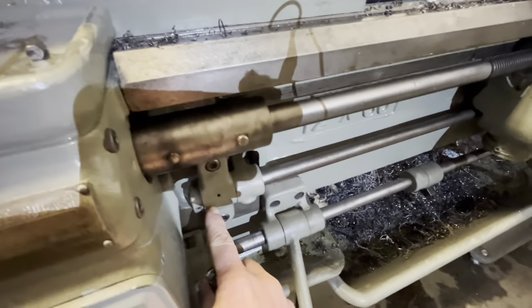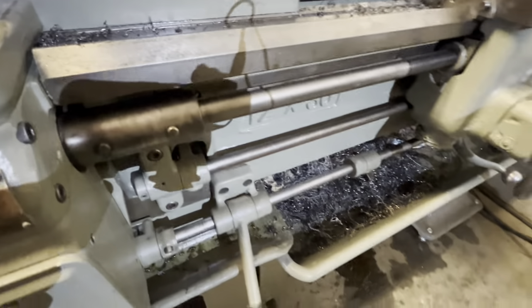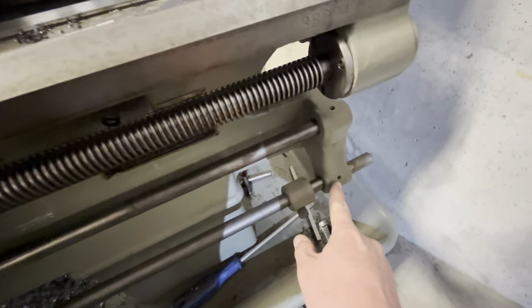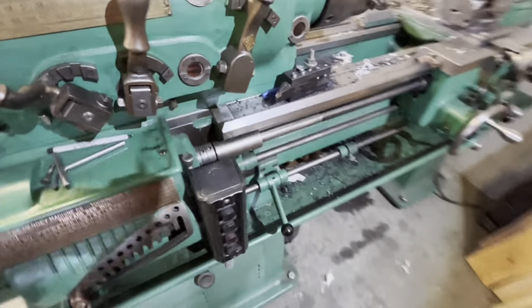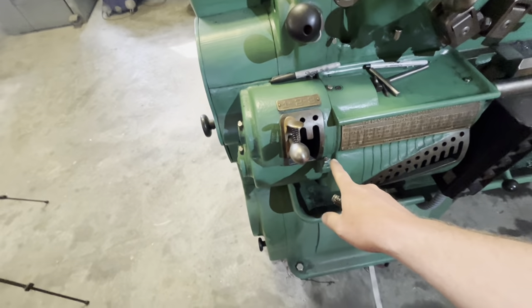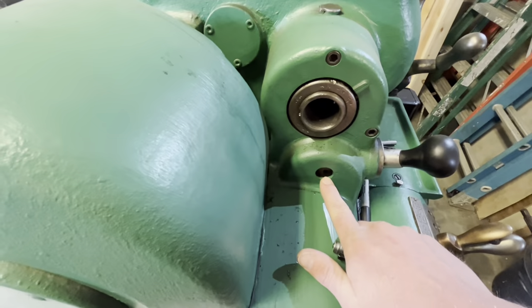There are also several oiling holes on the machine — some machines may have them in different locations. That one lubricates the rotation of that shaft; there's one under here and another one back here. Some machines will have one here or here. On the 12-speed machine there are more single-point lubrication areas on the non-pressure-lubricated gear change, so you have more areas to lubricate.